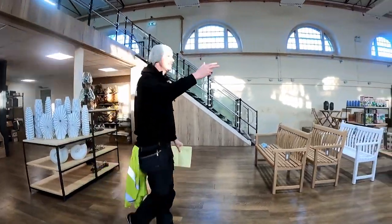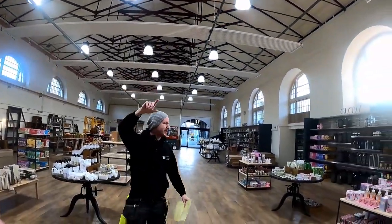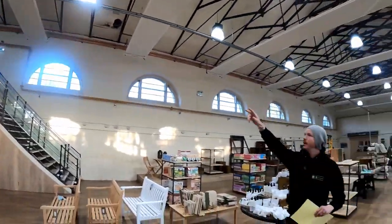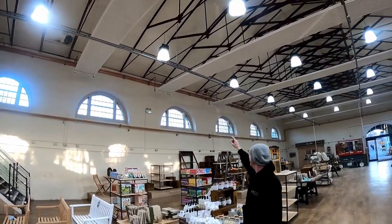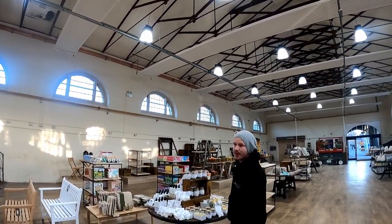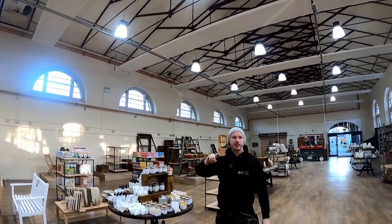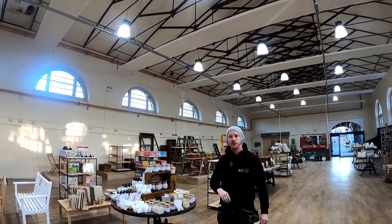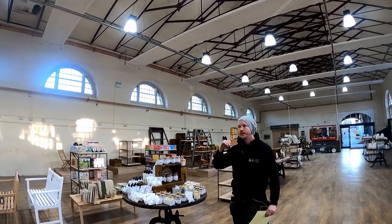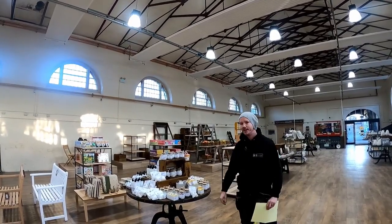This is the main shop room. Up there, which we'll show you in a minute, is the mezzanine. What we've wired in here — we've done a bit of cable tray along the top with 12 Cat6 cables going that way, various colors. We've got two to every point, so every point has got a main one and a backup, to be used for anything in future and as a backup just in case anything goes wrong.